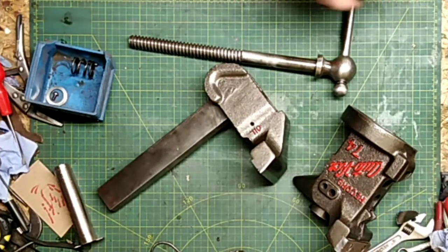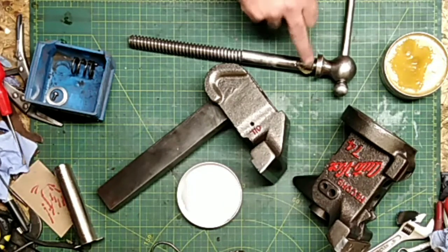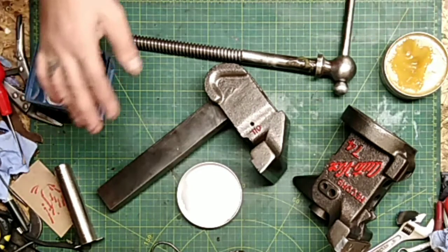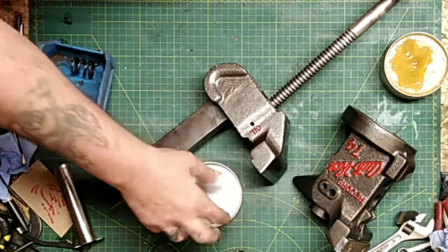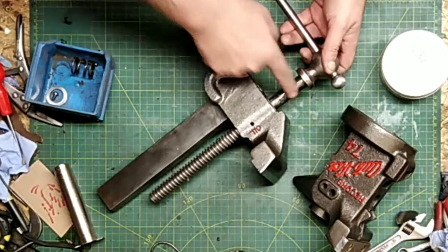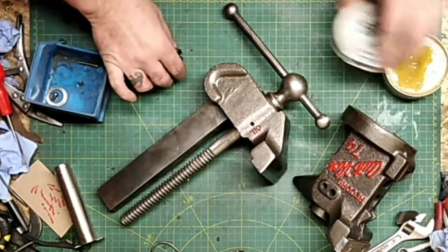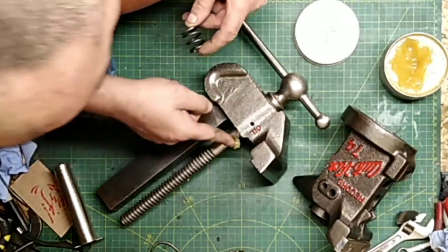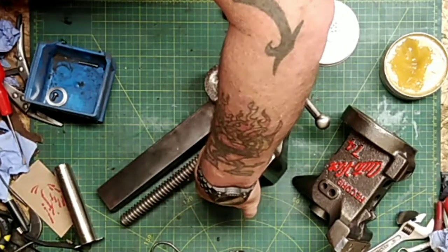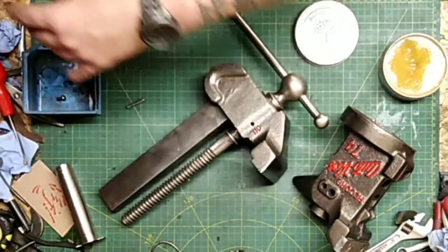Just finishing off the red, then it's time to put it all together. I'm using beeswax polish as a little bit of grease - putting this on the end where it's going to pass through the body, the bit where it's going to rotate. The spring will also push into this from the inside as it's kind of hidden and recessed in that body. A bit more beeswax and this will get pushed in as I slide the spring down the drive screw, sit on the spring and keep that nicely protected. On goes the washer - now to hold the spring in place.